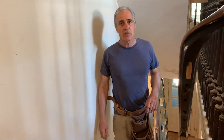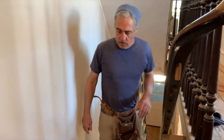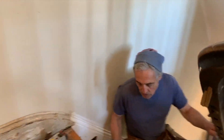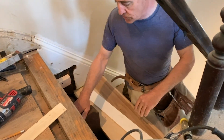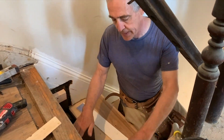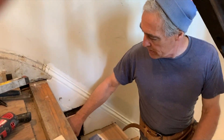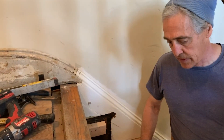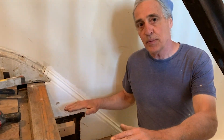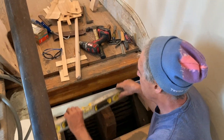We're at the top of this first run of our first staircase and we're doing the riser and the tread. I've stripped the tread and riser off - this is how it's been going all the way up. I clean these off because they're covered with a hundred years of dirt. We did a little repair over here because this one looked a little weak, put another helper piece on there. Once I got it set, I know the stairs have been going like this, so I know this is my high point, and we're putting our level on there.